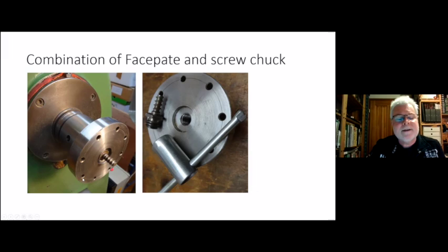The good thing is, normally when you're turning a bowl you don't want the core anyway, so it doesn't matter if you have an additional hole in the middle. It also centers the face plate in the bowl plank, which is quite handy. This is actually a 6.5mm screw I think, and I drill a 6mm hole for it — also a little bit smaller than the diameter, and it's not tapered.